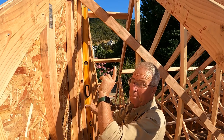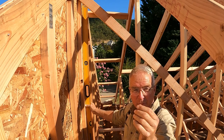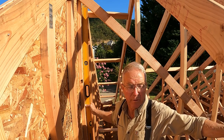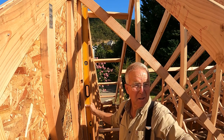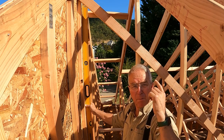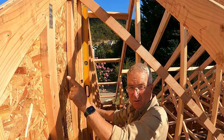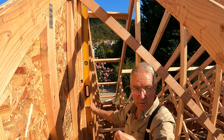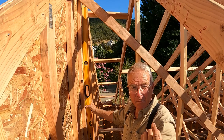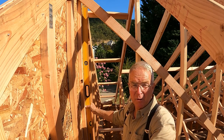The top of this gable end needs to go out three-quarters of an inch. I've taken a bit of a chance because I've got about eight pieces of sheeting in that quadrant of this side of the roof, because that end of the roof is perfect. I'm missing a few peak blocks up here so there's a little bit of flex — enough, I think, to push this out to where it needs to go. Let me show you how to rig up a pry in the rafters using stuff on hand, so one guy by himself can push a gable end out and control it pretty well.